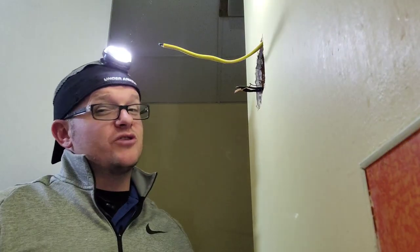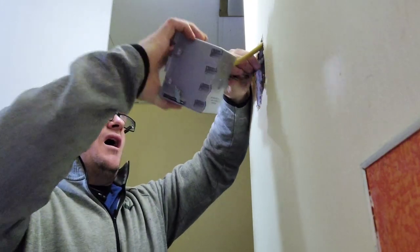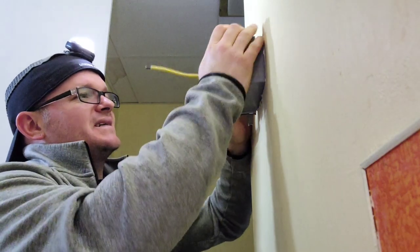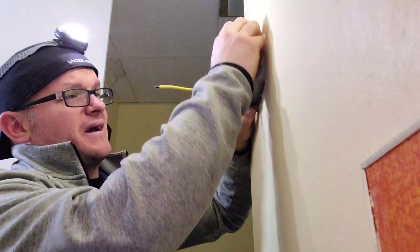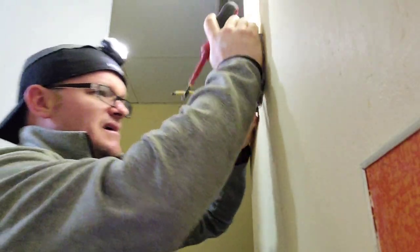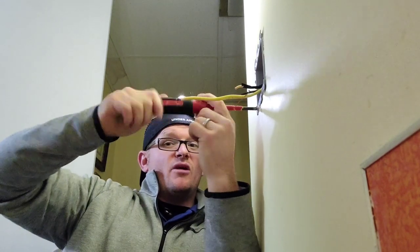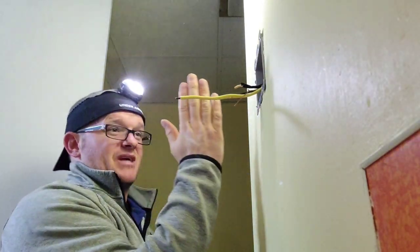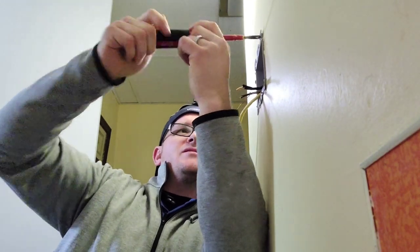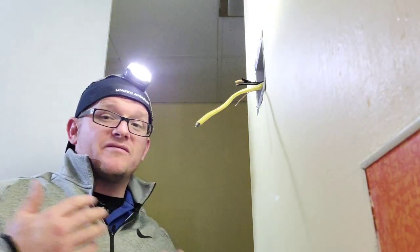If you buy the blue ones from the big box stores, you have to pre-work them every time or you'll end up in a nightmare. I work the wire in, and now we're going to talk about the next step, which is super important technically. When it comes to being technically excellent, that's what I want all your work to be — we're not going to allow average DIYers on this channel. I use two hands on the box because if you stop the pressure, that little tab will fall down on you. Now let's get our knife out to strip the Romex — this is arguably the most important part of the install.